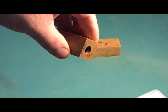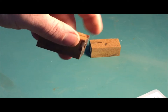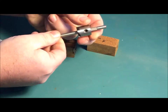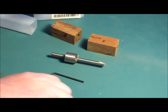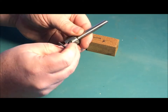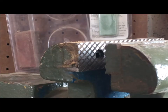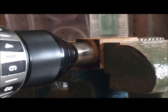If you've done it properly there's a little bit of wood left on the outside that we need to trim away to get down to that brass tube, and it needs to be 90 degrees to the inside so that our pen parts fit perfectly. What I like to use for this is an end mill or a barrel trimmer — these spin along the inside of your brass tube and the cutter head works to trim the end. You can buy these in kits with interchangeable shaft sizes for different pen kits, with different cutter heads, and you can even buy carbide cutter heads so they stay sharp longer. To use a barrel trimmer it's handy to have a vise, or you could clamp it to a table, and you trim away the wood until you reach the brass underneath.